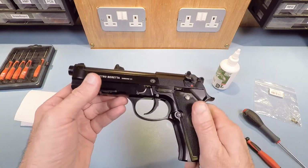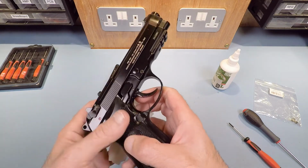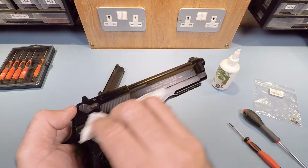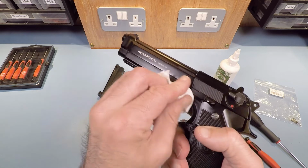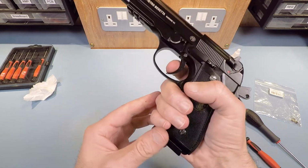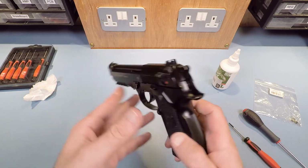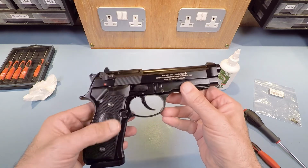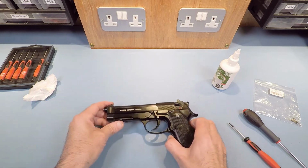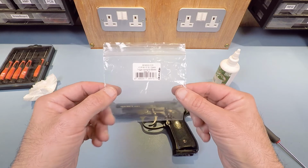Fixed gun. Okay, so you need to perhaps remove some of the excess lubrication you had when you did the reassembly. But that's pretty much it from the point of view of putting the trigger in. It's a relatively straightforward fix. You just have to be a little bit careful when you remove some of these parts that you don't have some of the springs pop out. But it's certainly doable, and you can get replacement springs from the guys at Bagnall and Kirkwood, or any other supplier.